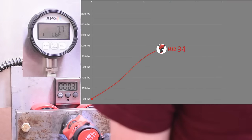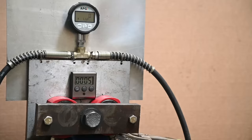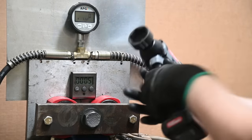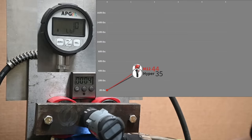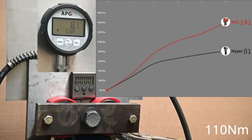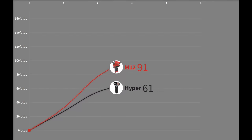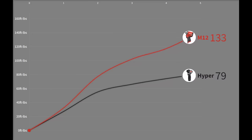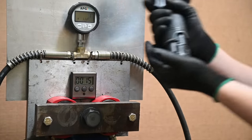Our first test is called working torque — five seconds in forward. The M12 3/8 does 141 foot-pounds — nice, fairly decent for 12-volt. The new Hyper Tough does just 81 foot-pounds. There's no need to pile on, but that is a record low out of 25 compact impact wrenches tested so far.